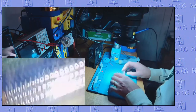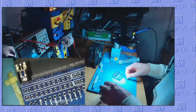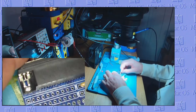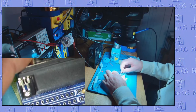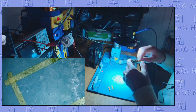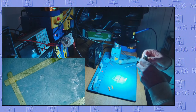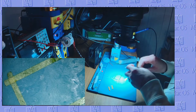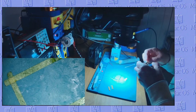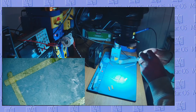Looking good. All right. Let's get our resistor nets in here next. This one's a 220, that'll go in the front. That one's a 331. Oh, one of the legs is bent. It's a little difficult to get in when that happens. Just needs a little coaxing, that's all.